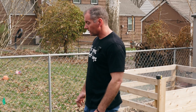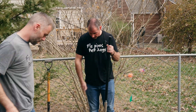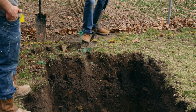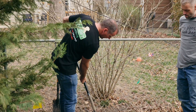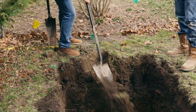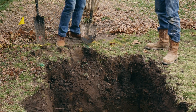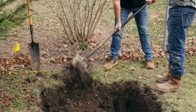I always like starting with a deeper ditch outside of the two-foot limits of the utilities, because it gives me a place to throw all my material. The gas line runs this way, and we're going to hand dig perpendicular to it. Gas lines are typically 18 to 24 inches deep. Anytime we're within two feet of that mark, we have to hand dig. I take a shovel depth all the way through, and then I get in the excavator. Now that I've cleared this bit — the width of our ditch — we know the pipe is not within this elevation. We've cleared this elevation from being a possibility. A lot of it also depends on how hard the dirt is; if it's super soft, you can go even deeper.